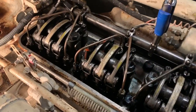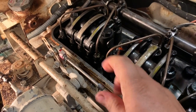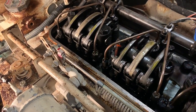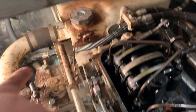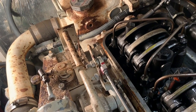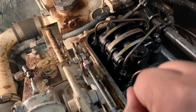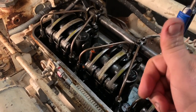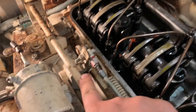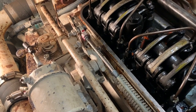All right, so I thought it tried to run away, but really what happened is Pam had the engine set to full throttle. So when she started it, I had to pull it to the off position. Okay, so I started taking the governor apart. I'm not familiar with this specific throttle linkage that's on here. Normally the throttle linkage is on top of the governor on the buses. This is something a little different. But in Pam's defense, this is a new boat to her. So when she went to start it, she has the throttle levers in the full position. This is actually off. So when we tried to start it earlier, this was all the way back, and all the way back is full fuel. So I thought it was trying to run away. Every time I would let go of this, it wouldn't go to idle. It would just race way up. And then I kept dialing it back down, and it would race up again. Well, that's because it was in full throttle. So a heart attack later and some heart medication, I should be good. We'll try and start this thing again.